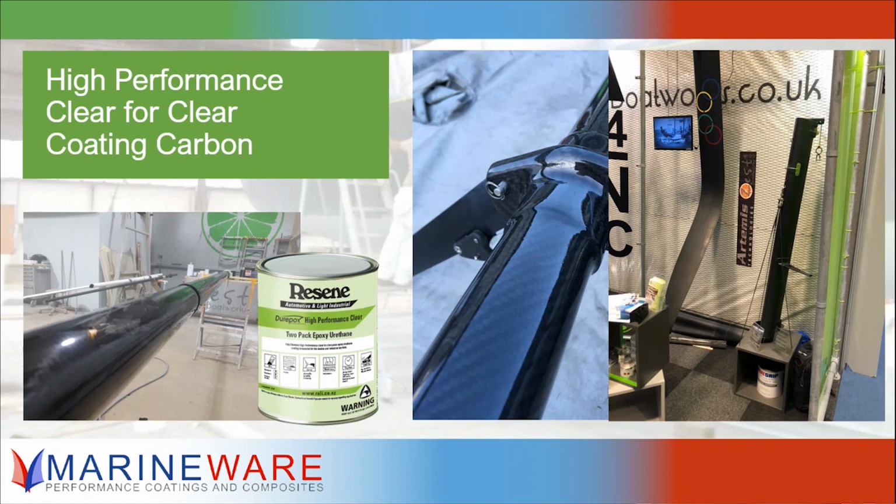It's designed to stick to bare carbon fiber. It's UV stable. It's not going to come off if you apply it properly. The amount of masts we've seen that have been painted with 2K car acrylic. The other popular one is Perfection polyurethane varnish. It all just peels off. It doesn't matter how well you sand it, how well you wipe it down, how well you prep it. It will peel off in the sun after a year.